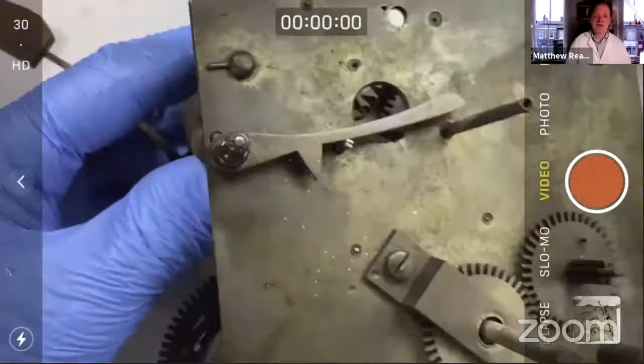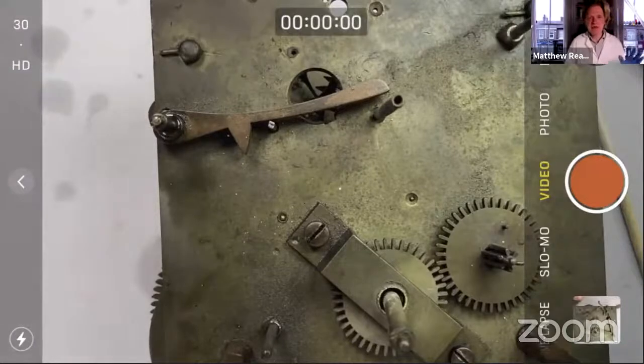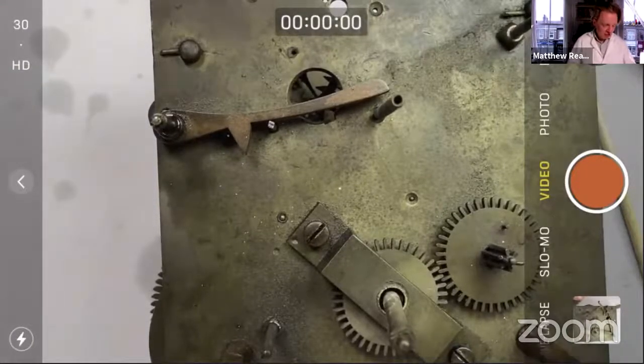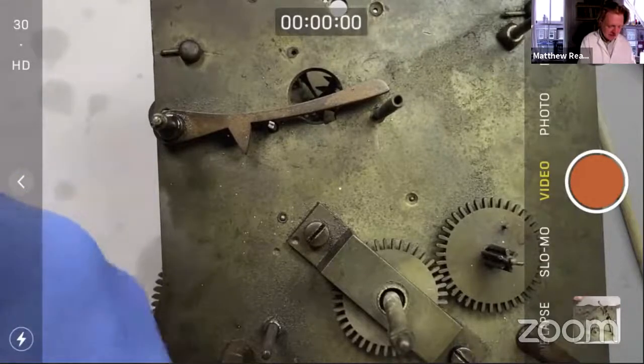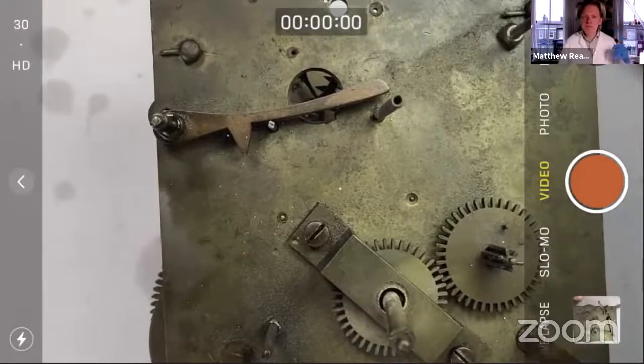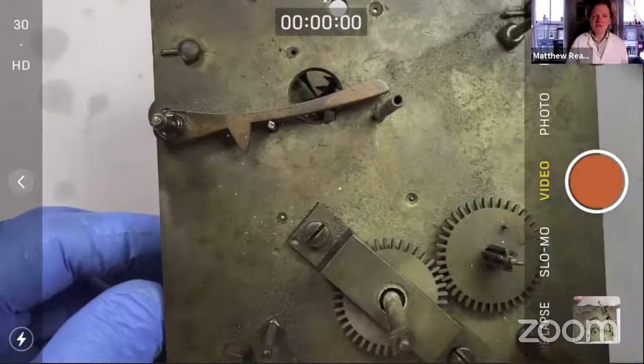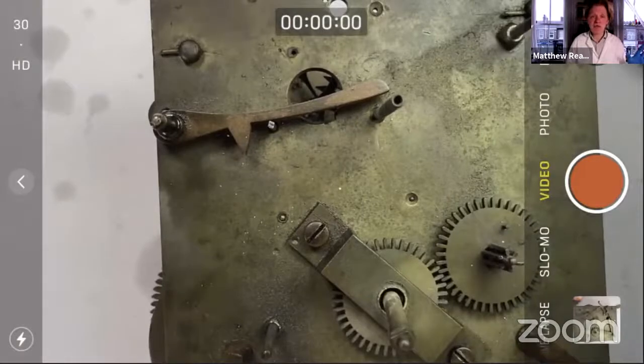It's really nice. I mean, I'm speaking too soon, obviously, but really nice to see these pins that haven't been driven like crazy into their holes. It's just not necessary to do that on center arbors, French clocks, and particularly rack posts. You often see the end of the stud split open. Sometimes it's been hard soldered, sometimes it's just left with a crack. Sometimes it breaks up altogether. It's not necessary to drive those pins in like crazy.